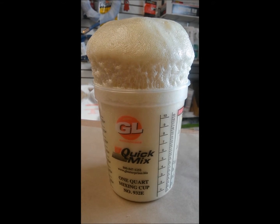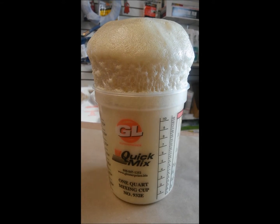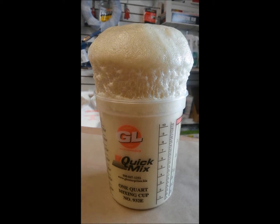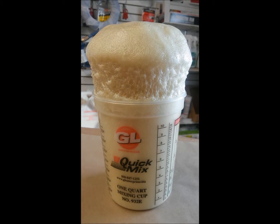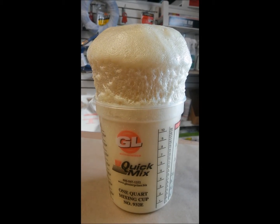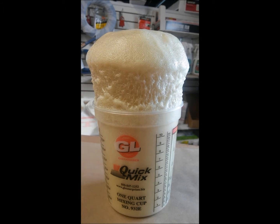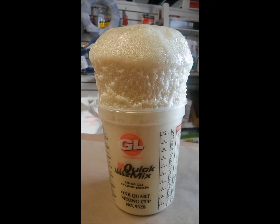You can see it continues to grow. Keep in mind you have to leave a vent hole in the bathtub so that any excess foam can come out and not make your tub bulge out and create unwanted bumps. It will be hard enough to actually hit and stand on in about 4 minutes.